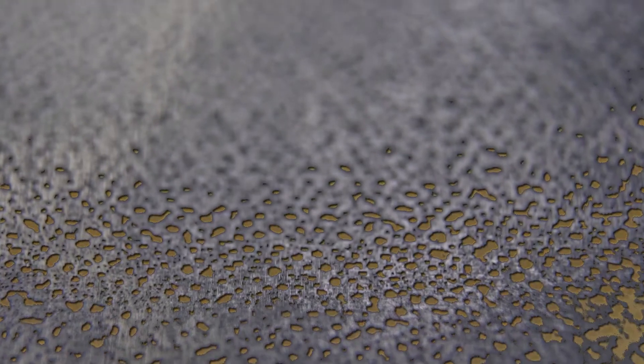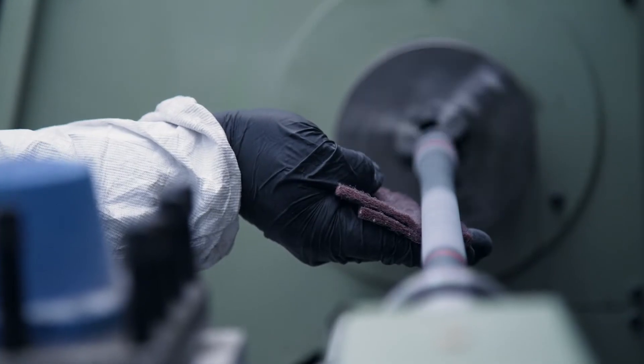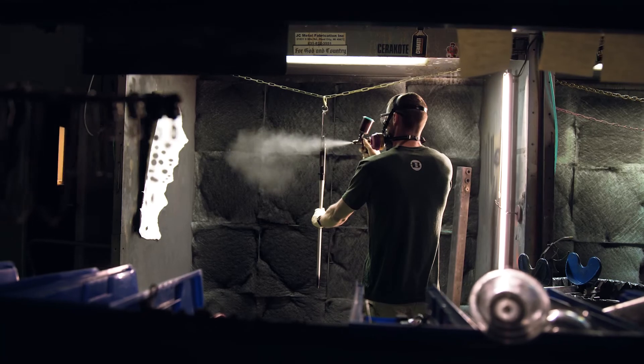With respect to the materials in this barrel design, we intentionally chose an ultra-high-modulus carbon fiber — basically a stiffer carbon fiber. The stainless steel is very thin, down to about 2.5 mils in thickness, and was engineered and designed specifically for this barrel. We didn't take any shortcuts with materials. We could have gone with cheaper carbon fibers or a different type of mesh, but we didn't want to. We wanted to use the best materials available today — literally the same materials used by the aerospace industry.